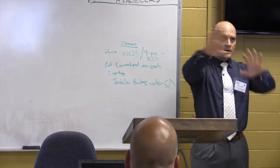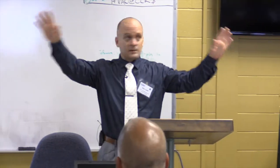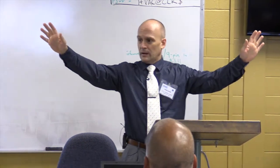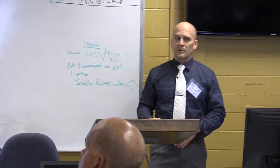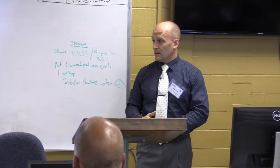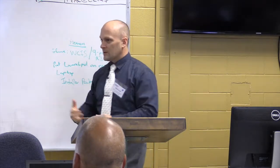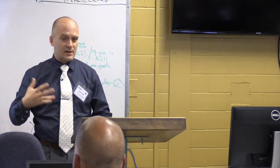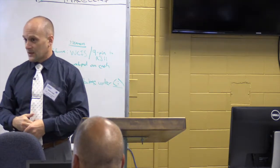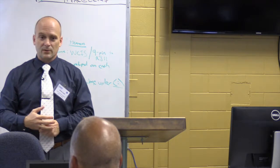We got a main trunk put in, and then we put in three VAV boxes in the front with electric heating and three fan power parallel boxes in the back with various numbers of stages — some have one stage, some have two stages. It's not a standard for the lab, because we wanted students to have that mix when they're learning the sequence.